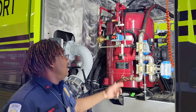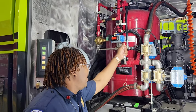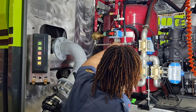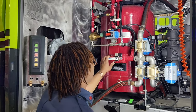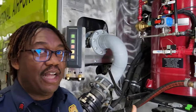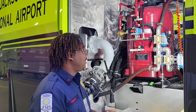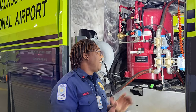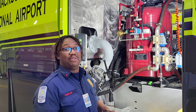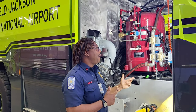Back on the other side now. We're going to put the dry chemical valve back into the normally open position — and this is your last step. Put the pin back in it. Now you've just fluffed your system. No mess at all. It takes at the most maybe 20 to 30 minutes to do. That was a complete video. I'm Sergeant Peoples — this is 'Fluff the Purple K on the Rosenbauer Panther 6x6.' We out. Thank you.